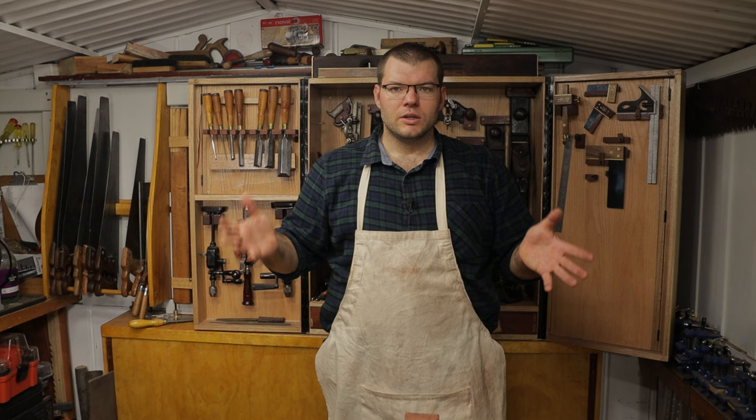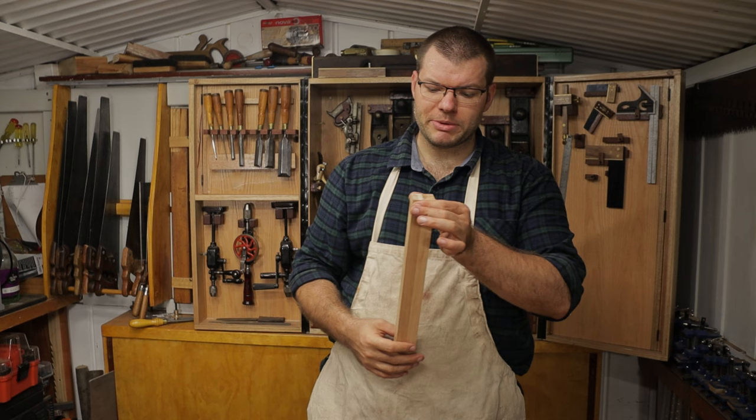So, as you saw there, I augured through until the lead screw came through the other side and then just came back from the other side. That gives a clean exit on both sides. To shape the handle, what we're going to do is we'll find the center of the top end,